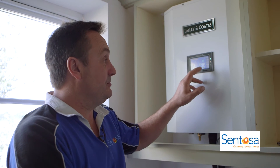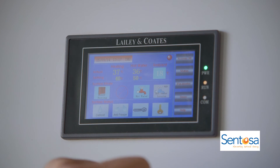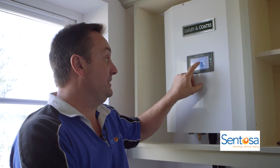Although the indoor unit is actually back to back with the outdoor unit, the outdoor unit can actually be sited up to 25 metres away from the indoor unit. The controls are quite simple to use. Ambient air temperature at the moment is standing at 18 degrees. The red light is saying that the heating is calling for heat, although it's not on because the hot water takes priority — in this instance it's set at 50 degrees, where the heating is set at 40 degrees. In this particular house it's doing underfloor heating and radiators.